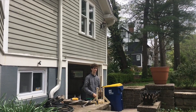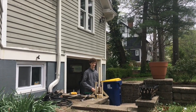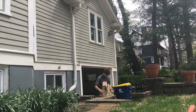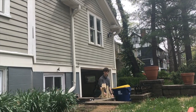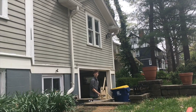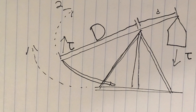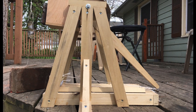After collecting data, we wanted to determine the efficiency of our design. We retested the changing mass experiment, recorded the projectile's time in the air, and used kinematics to find the initial velocity and kinetic energy of the golf ball, comparing it to the counterweight's potential energy. We found that as mass increased, the trebuchet became less efficient, which we believe is related to the release angle. Because of the way the torque curve works and the different rotational and radial motions in the trebuchet, it becomes very complicated quickly to find what seem like simple things.